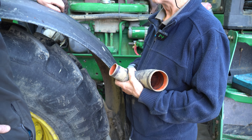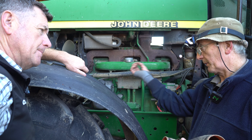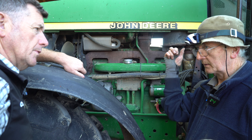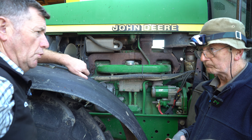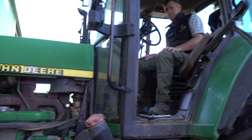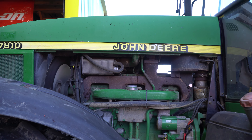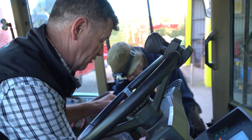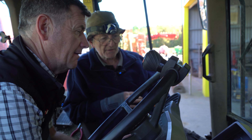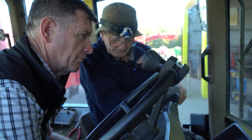We were onto Johnny below, and he was saying to check the common rail fuel pressure sensor — check the pins on that, which is on the bottom of the fuel rail on the far side, and there are two other pins at TFO or something. We tightened the pins but we're still in the same boat. Now we have a warning on the dash we need to investigate. Need to go up into the codes and see what's on the diagnostics.